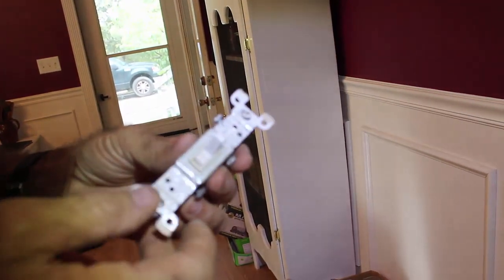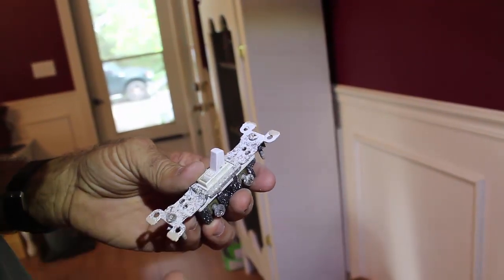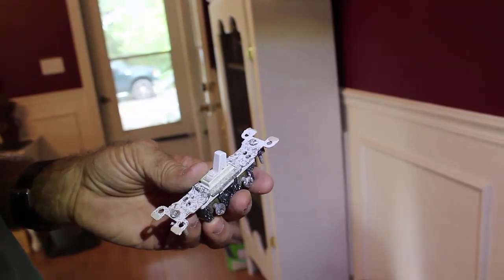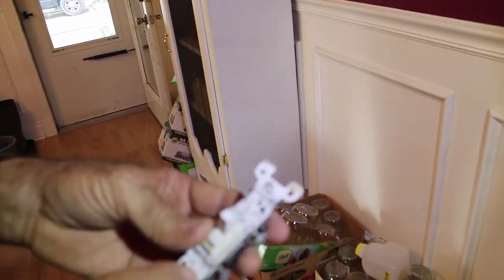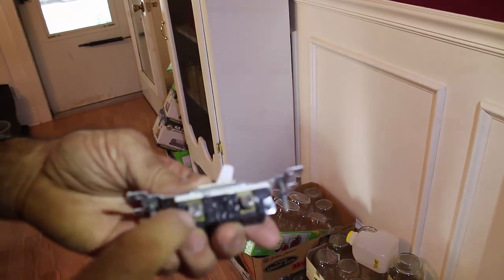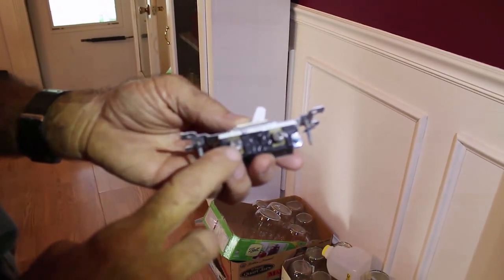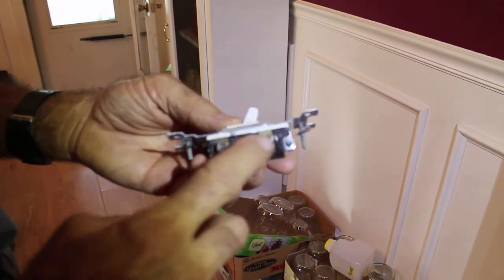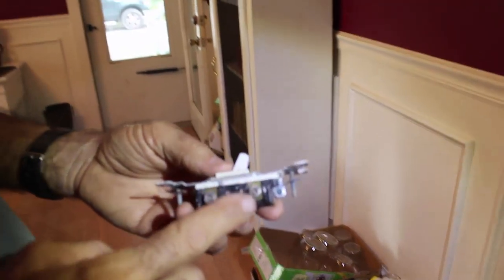So a lesson learned: if you're building a house, and I'm a contractor who never once thought about this in 20-something years because I've never had to go back and face this, when you spray your house with sheetrock and do sheetrock mud, make sure it does not get on these terminals. See, one of these is supposed to be gold and one of them is supposed to be silver, and it's corroded them up to where you can't tell which is which now. So that's a lesson learned